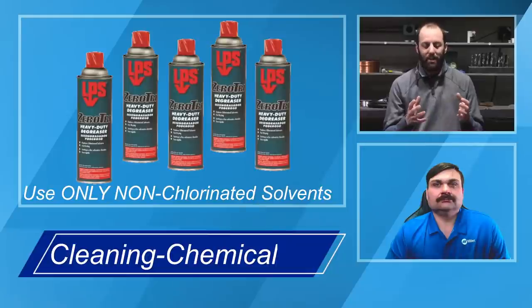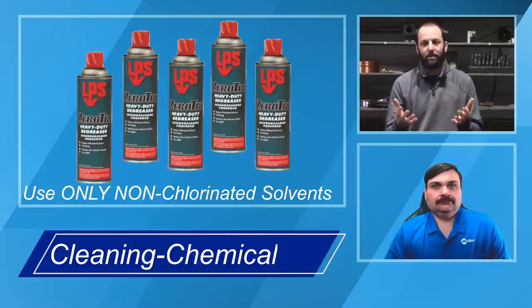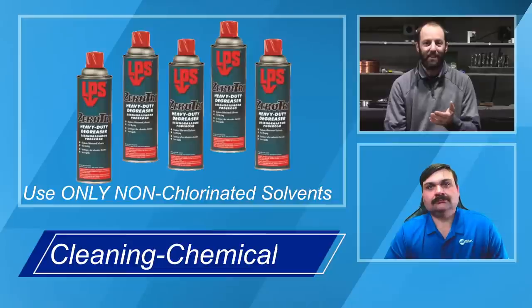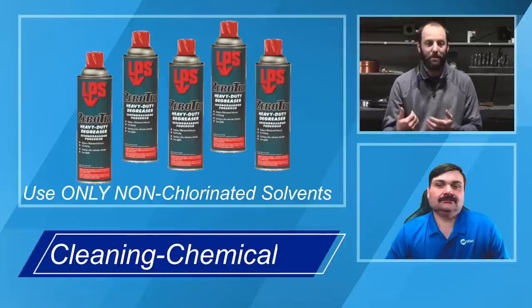Ultimately what that can cause is that those laundries or services that provide that, you get those things back and they're stained and discolored. That means there's still a little bit of residue left in there, along with whatever detergent they used in the laundry process, which could be getting deposited onto your base material prior to welding. Depending on how clean it is, the solvent could be washing that detergent and that grease or oil residue out of that rag onto your part, versus what we're intending to do, which is actually pull any contamination off of our base aluminum.